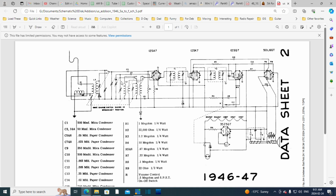Here we are. Here's the tuning capacitor with the two sections. And it's showing them ganged together. One of these capacitors is across whatever is hooked up to the front of the radio, depending upon this switch. So this capacitor could be across this coil here. So this might be the larger coil. I'm not even sure now which is which. The larger coil on the antenna, and the smaller coil might be this one. This is a fixed capacitor here, not tunable. It's probably a trimmer. You probably can tune it, although we've marked them all here, so it doesn't look like it. It looks like this is a fixed capacitor, trimmer here for shortwave, I would think.